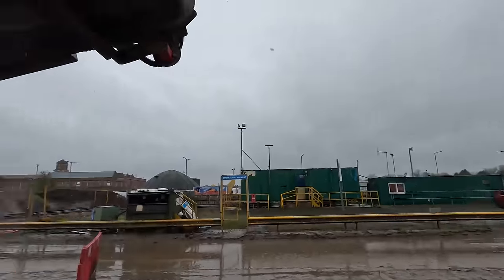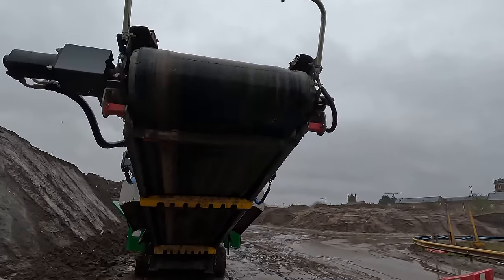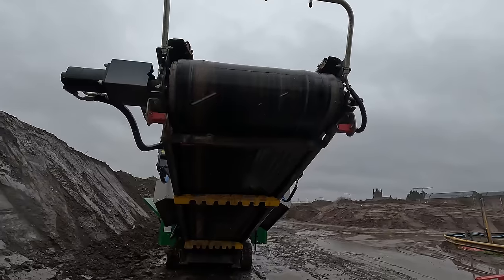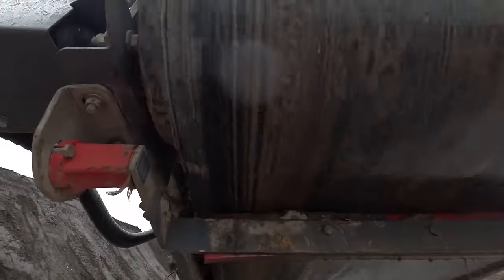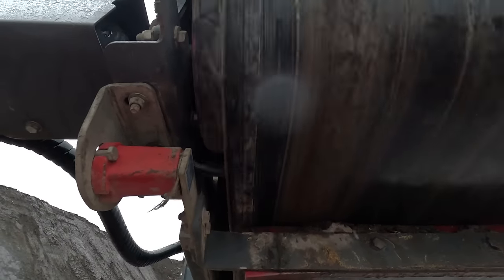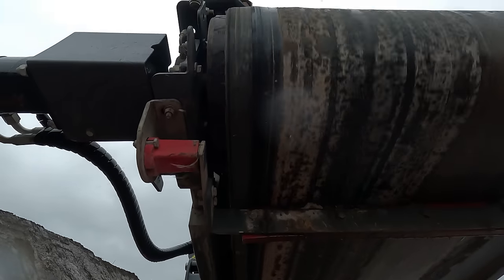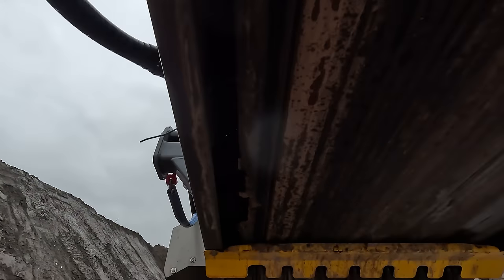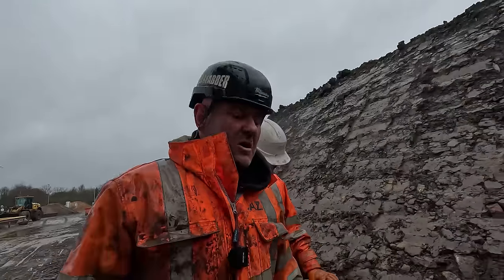Yeah, that looks good. Cal has put it back to the position where it was when we first came here. So can you see how it's central in the head drum there? Now then, the belt has got a nasty gash in it. So again, what I'll do when it comes back to the shop, we'll put a patch in the belt. Is it okay at back end, Cal, yeah? Right, that sound. Right, let's clean up tools, wrap up, get on to the next job.